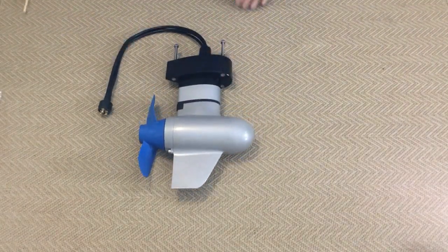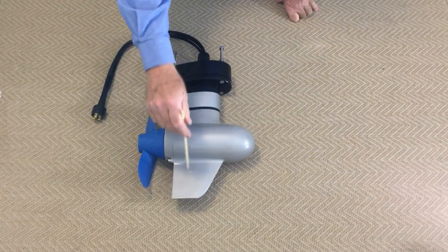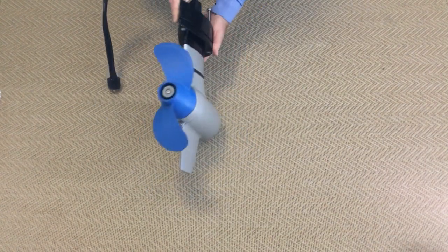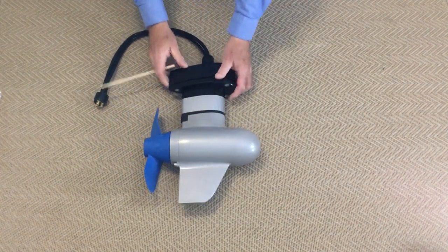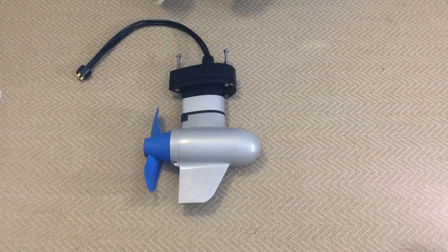As you can see, it's the same motor as the Navi 3 outboard, so it's a nice solid piece of aluminium. The skeg is aluminium, so it's all nice and solid. The propeller is 260 mm diameter, 171 mm pitch, and it spins at 2,300 rpm. In the end of the propeller is the anode to protect the aluminium from corrosion, and they provide you with an allen key in the accessory kit to undo that when necessary. The motor being inside the aluminium and under water — that's how the heat dissipates from the motor and keeps it cool.